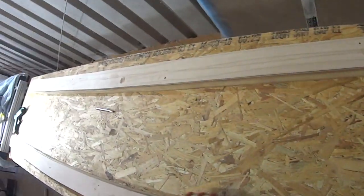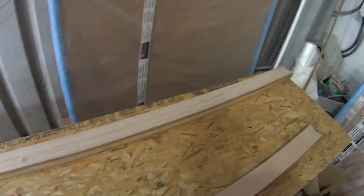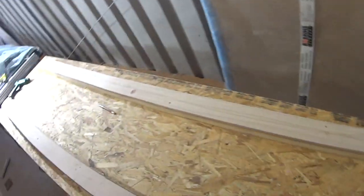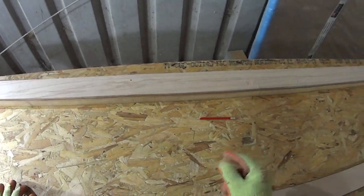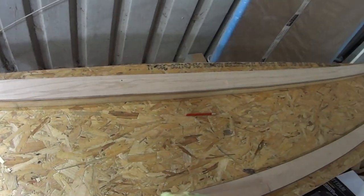The trick is to get just the right amount of margin either side. You don't want to have too much waste wood here. I found with that trim router that it really only likes to take off one or two mils - two mils tops. But obviously you want to leave enough so that you've got something for the bit to dig into. You don't want a void here.